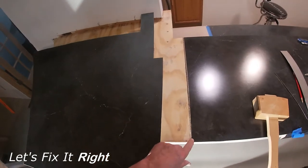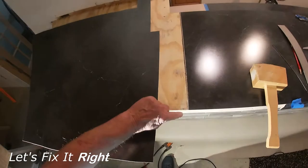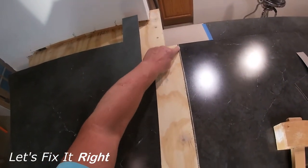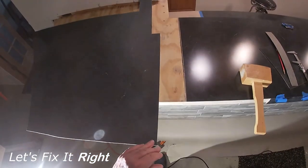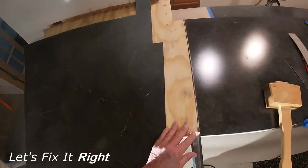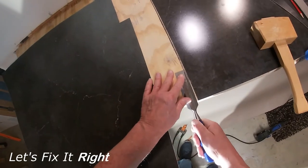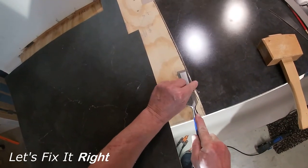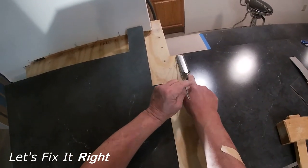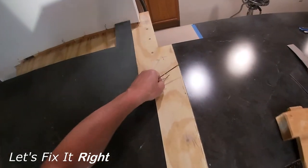For the laminate on the right, which is bonded to the plywood bar top, there's a very small trail of remnant remaining that is glued in place. It held really well. In addition, this trail, which varies in width, demonstrates the previous irregularity of the edge. Using my wood chisel, I'm going to remove the strip at this time. That easily removed it.